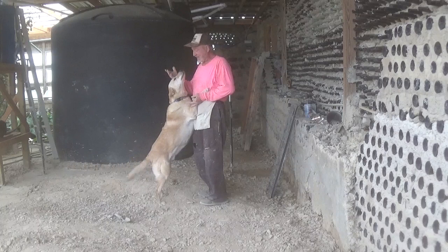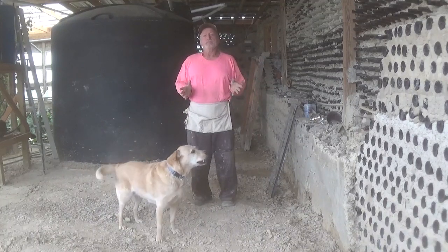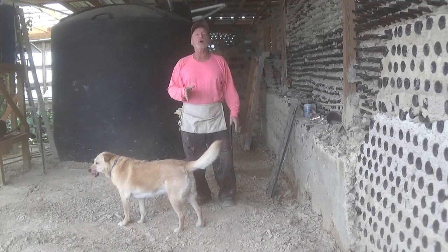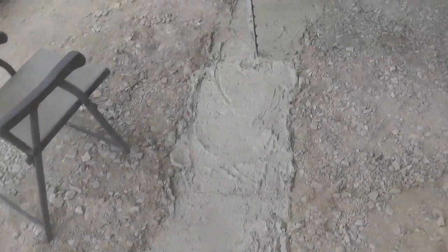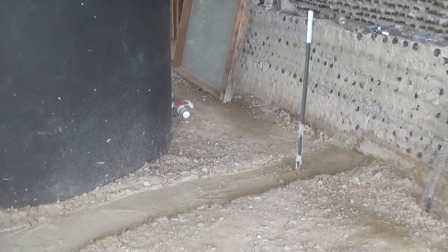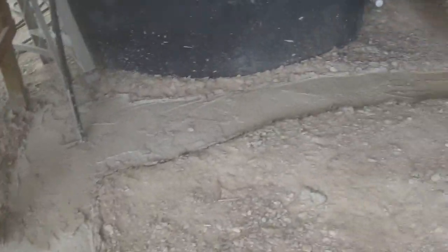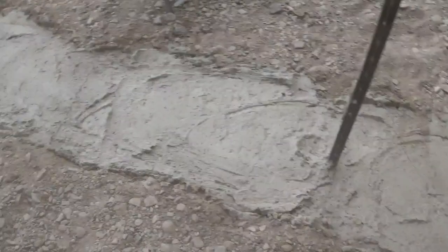It's been a few days and the heat finally broke — a cold front came through. We've got a beautiful cloudy fall day here today. I have finished part one of the cistern, and I want to get behind the camera and show you. The footing is poured. The pipes you see in there are just for a little bit more lateral support — we're going to have a lot of weight pushing out when the water gets in here. I've got a way of fixing that by attaching some other supports to the roof as well. The footing isn't pretty, it isn't perfect — there's not a contractor in America that would approve it, and there's a whole bunch of people that won't sign their name to it.